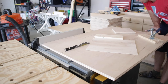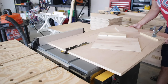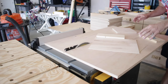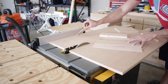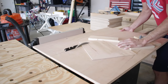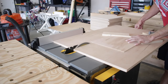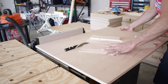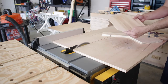Now it's time to cut the hexagons. Thanks to DIY Montreal's video I was able to make my own hexagon cutting jig — and man this thing is awesome. The jig in her video was a little smaller, but since I'm doing giant hexagon tiles I needed it bigger, and my contractor table saw required me to build an infeed table for it to rest on. For the first cut you have the full board straight, then take it off, rotate it, put the stop block under the clamp, and work your way around the board. You just go back and forth.